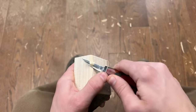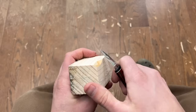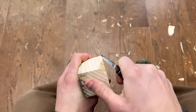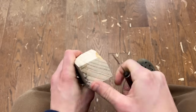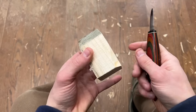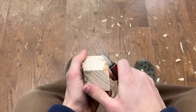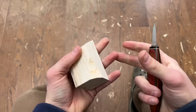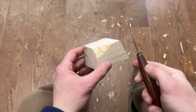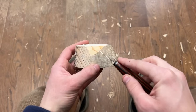It's very smooth — it's pretty buttery. It's a very even cutting wood. The downside to pine is you do have hard and soft winter growth rings. When you're carving a wood, you're looking for a wood that's homogenous — meaning a wood that is even all the way through. The presenting challenge here is the hard growth rings, which indicate the winter growth of the tree.